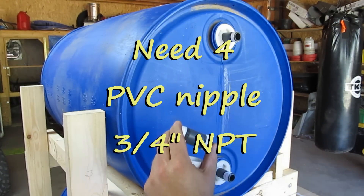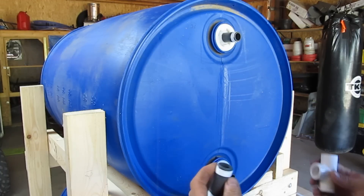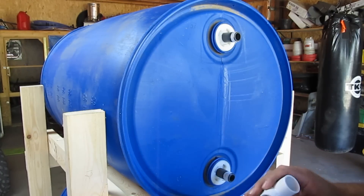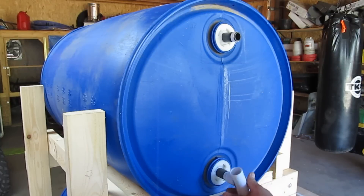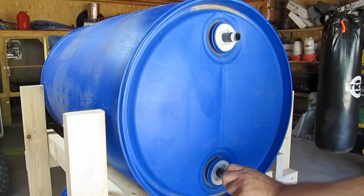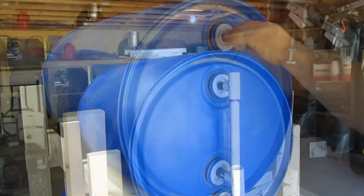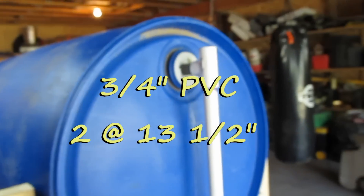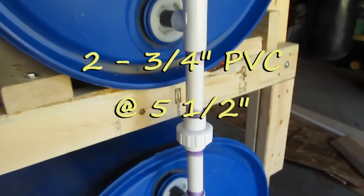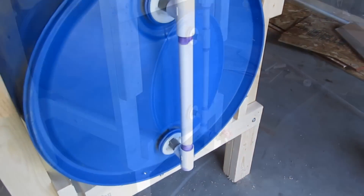Use a 2½-inch nipple, a ¾-inch pipe thread, and a ¾-inch pipe thread with a T, and you're going to go around like so. Put Teflon tape on all the threads. You have two T's — piece of pipe in there. I put a union in here so if I want to break this unit apart. Another T and another T.